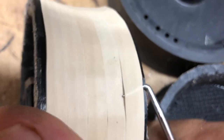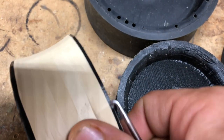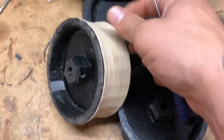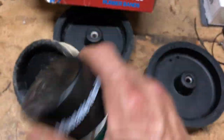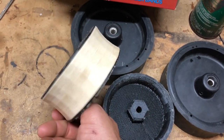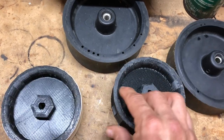Run the tool around the wheel to get it nice and straight with the tension even all the way around. I did about two or three layers of these rubber bands, then sprayed it with 3M adhesive and smoothed it around — that way it became one solid rubber band.